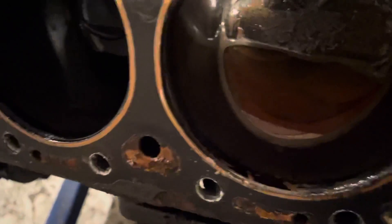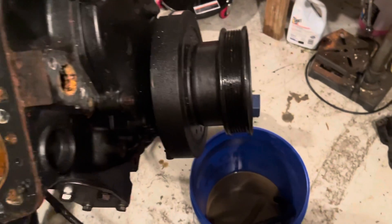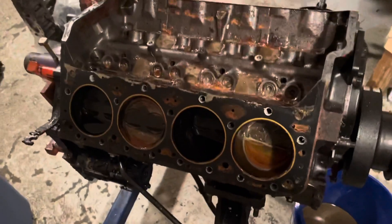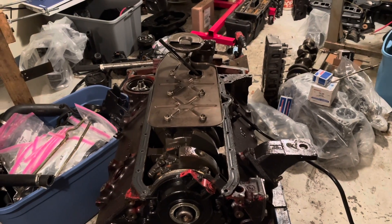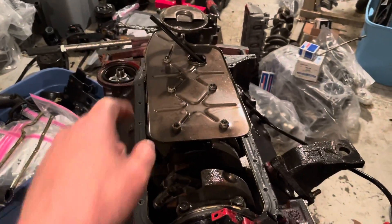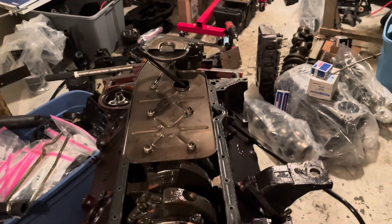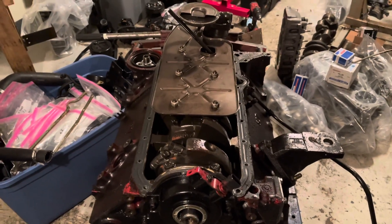So at this time we're going to continue working on tearing this down. Next I'm going to remove the starter, the front harmonic balancer, and then remove the oil pan and flip it upside down. The next video will show this engine with the oil pan off and flipped upside down. Continuing, I've already removed the harmonic balancer off the front of the engine, removed the remote oil filter adapter, and I'm about to remove the oil pump, the windage tray, and the oil dipstick. Then I will take off the front timing cover and work on the valve train.